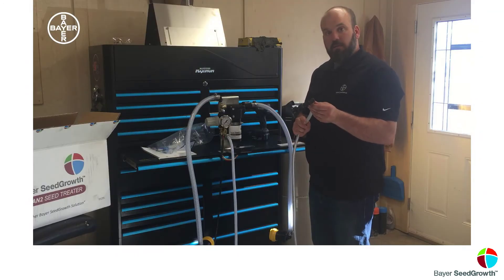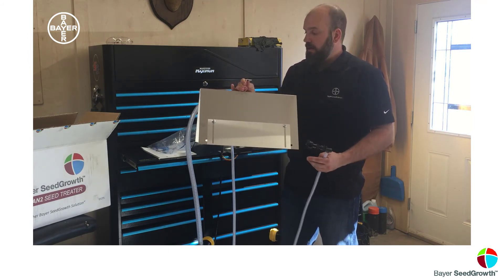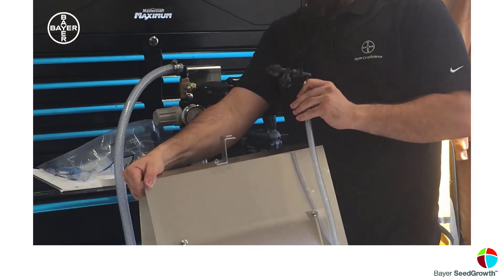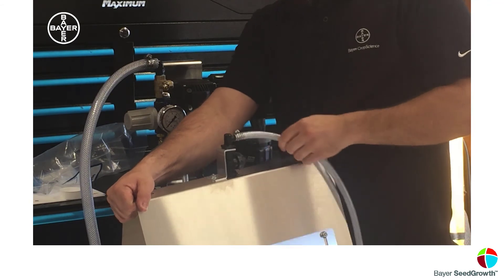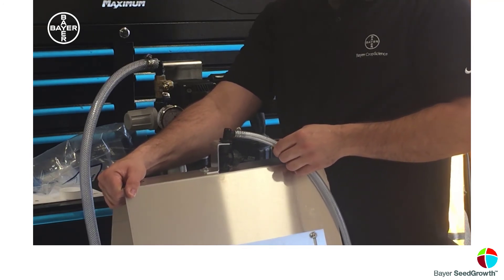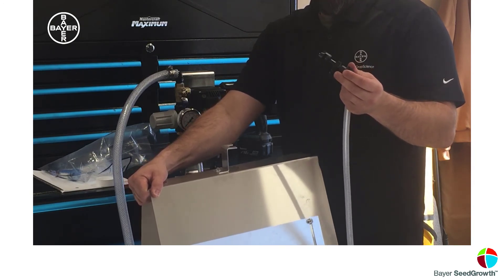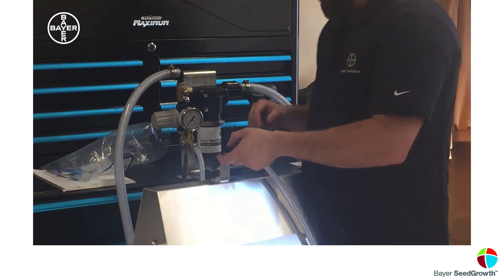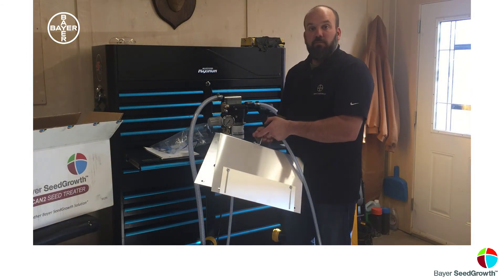Now that you've got your nozzle and everything attached, we won't attach this to the auger right now. You'll see there are holes here — what you'll do is wire that to your auger. In the manual you'll see how to do a proper bushel calculation per minute. You're going to take this and insert it in here. You want to go parallel to the throttle plate so the spray pattern is going this way, not across. Just insert like this — you can zip tie that if you like. If you know you're only going to be doing a small job and then quitting for a week or so, you can actually take it out, pop this off, throw it in a can of water, and that'll keep everything from getting gummy. There's a diaphragm in here so you don't have to worry about the hose draining out. I always recommend if you're going to do anything with that, make sure you shut off this ball valve so there's no chance it can siphon out the container.